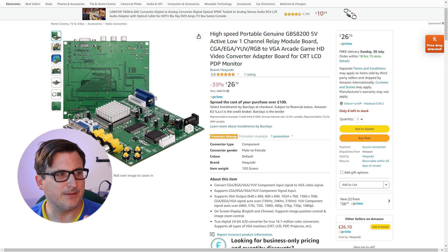I need to figure out the best way of getting the video output from the Raspberry Pi into the monitor. I can make a finger connector to connect the Raspberry Pi to the JAMMA connector, but the video signals out of the Raspberry Pi come through HDMI, so I'll have to think about that a little bit further.